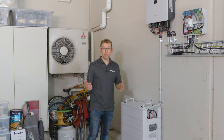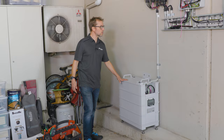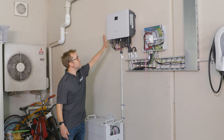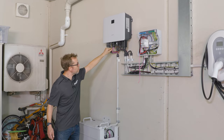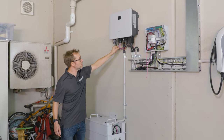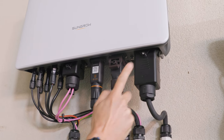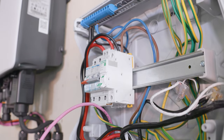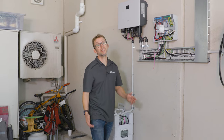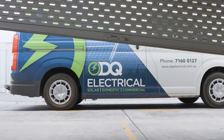So that's all the work done in the garage. We've got four battery modules installed, wired up with power and data to the hybrid inverter. In the hybrid inverter we've got the two solar strings (east and west), the battery power connection, data to the battery BMS, data to the Sungrow smart meter upstairs, the Wi-Fi dongle, the backup circuit, and the grid connection. In the subboard we've added a 20 amp breaker for the backup circuit. The remaining task is to run a 6mm cable from the garage up to the unit for the backup circuit.